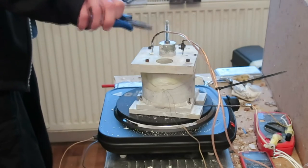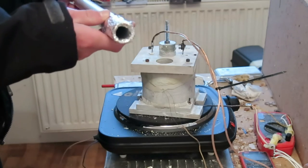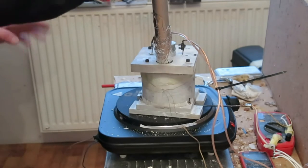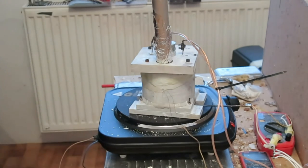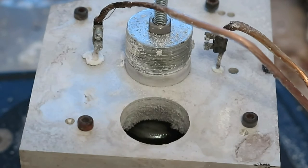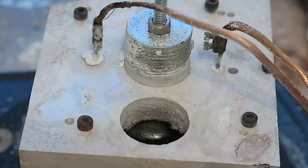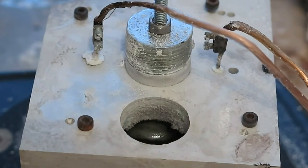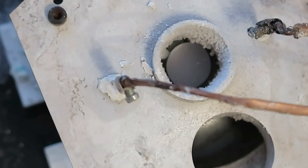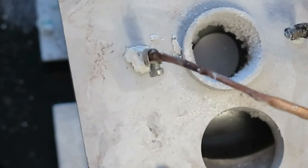I also place a long aluminum tube sealed with aluminum foil into the oxygen exhaust hole. On top of that tube, a piece of cloth is used as a particle filter. This is also to prevent fuming. After about an hour I turn off the power supply and take off the lid of the collection tube. You can see that on the lid is a chunk of solidified salt that contains small particles of metallic sodium, so I break it off and throw it back into the collection tube.